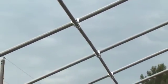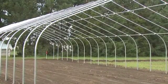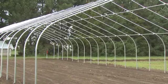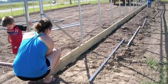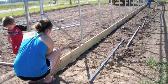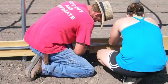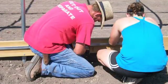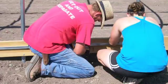This ensures the spacing between bows will be maintained as well as support the exterior covering. Keep in mind that the number of purlins is key to supporting the whole house. We recommend a minimum of six purlins and one ridge member. At the base and running the length of each side of the house, install a baseboard to the bottom of the bows. To this baseboard, attach a polyethylene retention system such as polylock or wiggle wire. This also supports the structure while holding the double polyethylene roof in place.